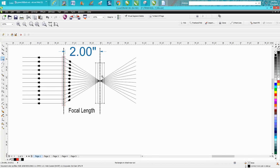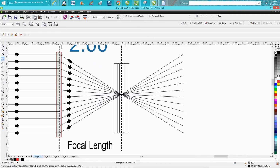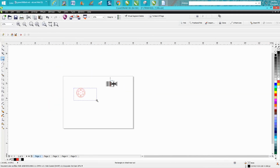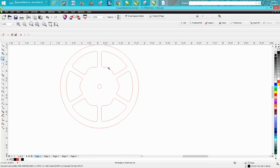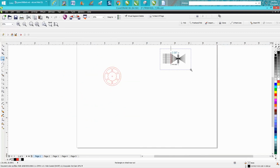So you could have a 120-watt machine, and if it's still got a 2-inch lens, it's still going to be out of focus. Now you could make multiple passes, but I would never even try to cut 1/2-inch plywood with a laser. So he's going to have two options, and I'm going to hopefully show them both in the next series, maybe called focal length.